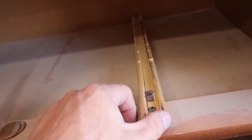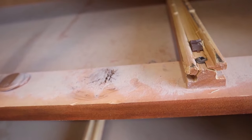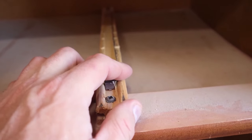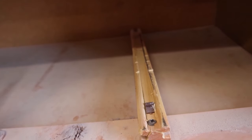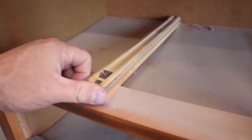This one is split. It's a really odd size track, so I don't think I'll be able to order one in. I've got a bunch hoarded, but I don't think I have that size. So we may take this one out and just see if we can glue it back together and then flip it around the opposite way so the split end will be on the back where the drawer really doesn't touch. Yeah, they all look like they're split. We're just going to take them all out, get some really good glue in there, glue them all up, flip them around backwards so the split ends are on the back side. Hopefully they never split again and it should be all good.